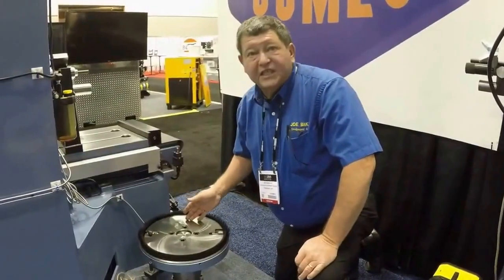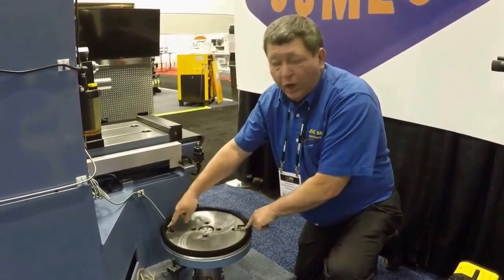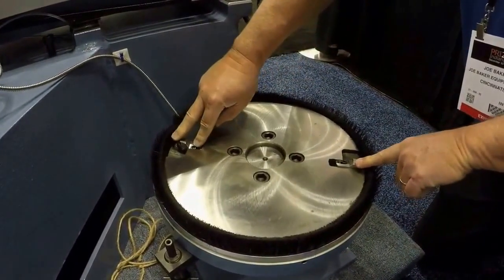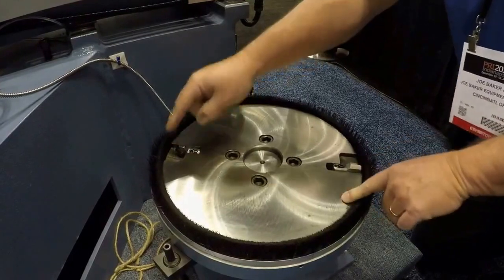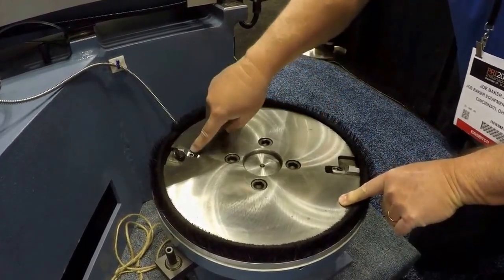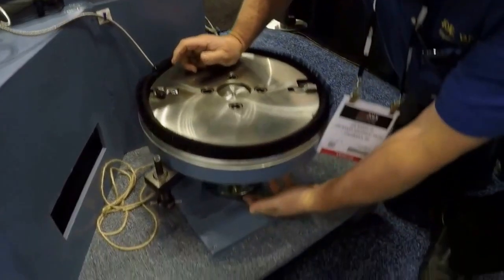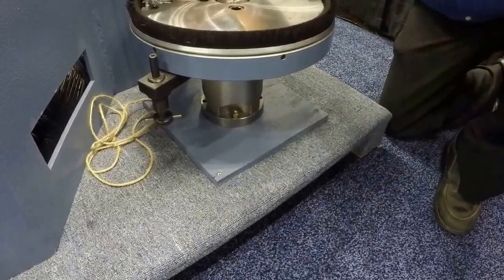This is the standard ACF200 CBN milling plate. It is 13 inches wide and comes standard with two CBN tool holders and the Comec feature of the incline slide PCD. That acts as a counterweight as well as your PCD. Nothing must be taken out to switch from CBN to PCD — loosen up one set screw and move it in and out. Very simple to connect to the machine: tighten four bolts and you are ready to go.